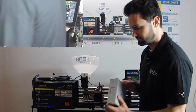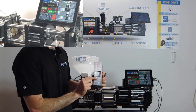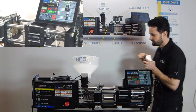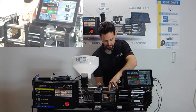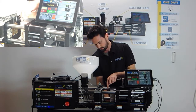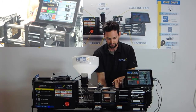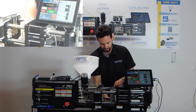The first thing to look for when installing the new mold is the mold temperature hole — it's going to be on the bottom left. Slide the mold in the same way we took it out, keeping your hand underneath. Before fastening the mold claws, make sure that the top of the mold and the block are level. The reason is that there's a hole here where the nozzle will inject plastic, so you want that hole to align correctly. Then there are grooves on the mold — push the claws all the way into these grooves before tightening the bolts.